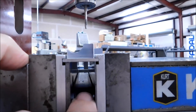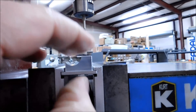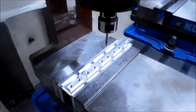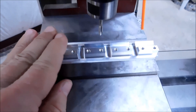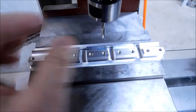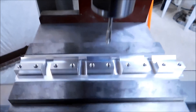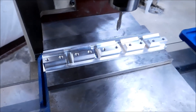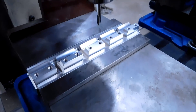There's a tool bit in the center and a bunch of feeler gauges to establish the wiggle side to side — it is minimal. The beauty of these tapping heads is you can be just a hair off center as you're coming down with the tap, the tap will float a little bit, and the part will float a little bit, and everything will find its own center. Probably have 400 holes to do, like I said — let's turn this machine on and see what it can do.